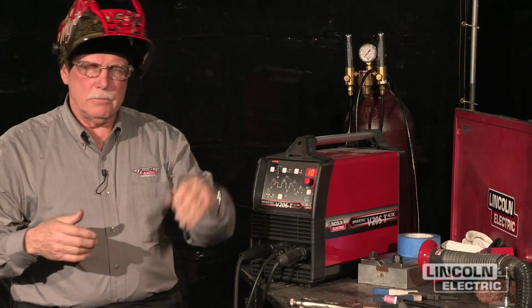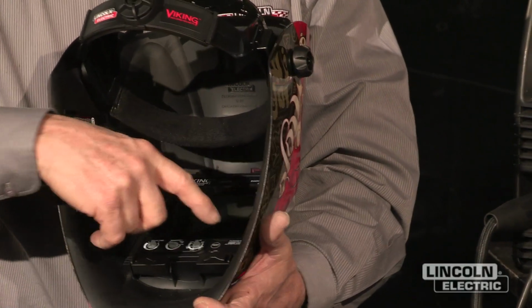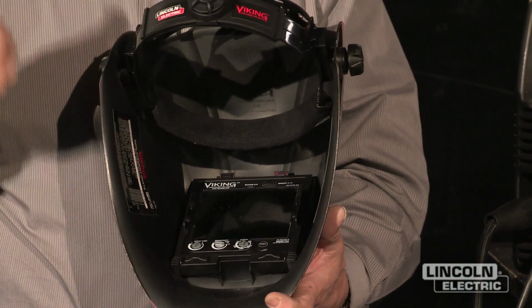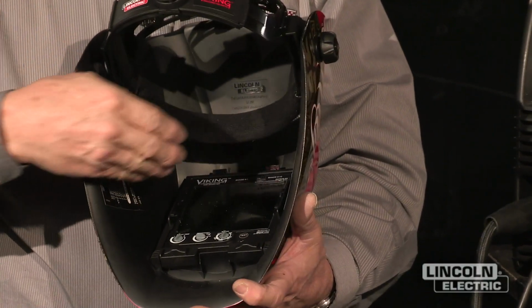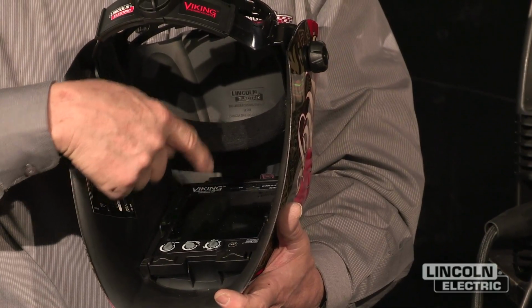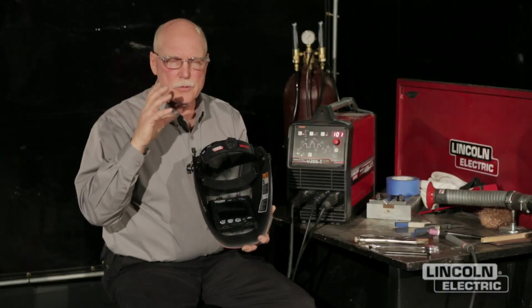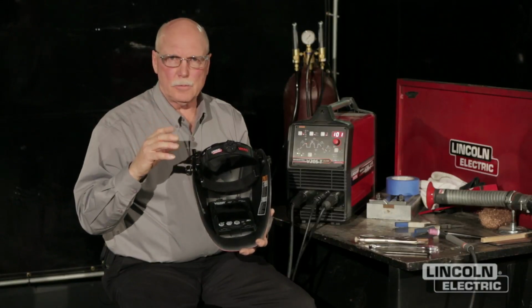So it actually doesn't just replace magnification lenses. It actually does a better job than them, because we can focus at any distance. You can focus that with your glasses with your helmet on. The helmet's capable of magnification lenses, and some people like them, but they come in set increments, 1.25, 1.50, 2.0, and you go from that to looking above or below that lens to nothing. With your glasses, you got the best capability of all.